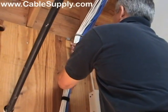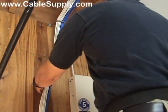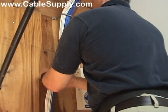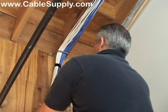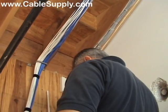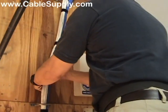Right now you're doing cable cleanup before you do your punch down. We use Velcro tie wraps — the reason why is it's easy to add cables. You're always going to add cables in the future. Rather than use regular tie wraps that have to be cut and put back on, we use Velcro. We cut our own — get a roll of Velcro; it comes in 25, 50, and 100-foot rolls, and you just cut what you need.